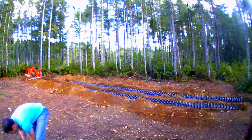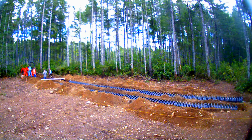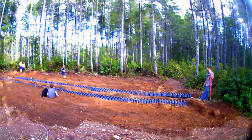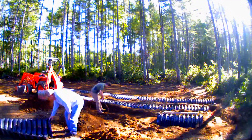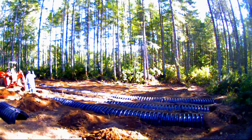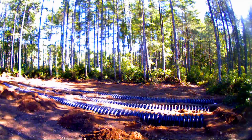The septic design drawing calls out the depth that these need to be installed into the ground. The uphill side, the side closest to the camera, was eight inches, and the downhill side farthest away from the camera was six inches. He also went back through and put dirt up against the sides of the infiltrators — it's called the louvers. There are little slits in the side and those are required to be covered before the final inspection. He's installing the third run now and has two more to go.